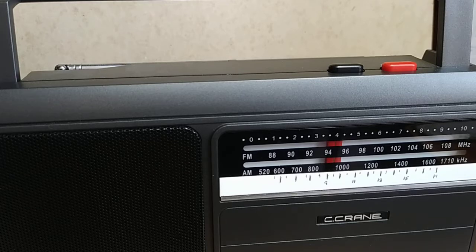It's a pity they didn't actually put markings similar to this on the radio. With a string-chord type dial mechanism each radio is a little bit different, so you'd have to hand calibrate every radio, which is probably not practical. But they still could have incorporated some markings for a starting point. There is a logging scale up top, but I want the actual reading directly on the medium wave dial.